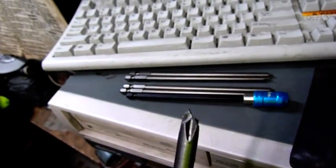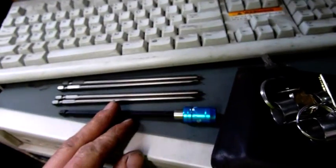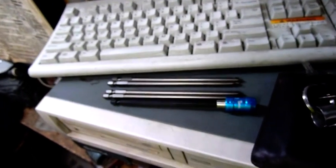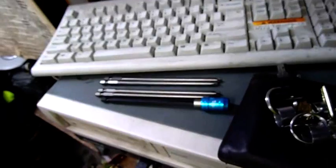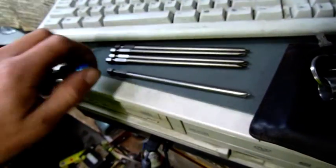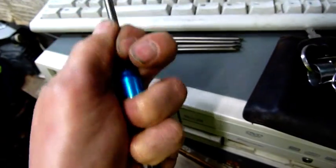What next in this constant parade of interruptions — that day can break my last screwdriver bit, just had to run out and get some more. Those screws are remarkably tight so I think I'll be using a socket on them. They're like a roofing screw with a cross-recessed head. Cross-recessed is like for service techs with big chunky screwdrivers, not these brittle hardened things attached to a power drill. I've got that and a little extension too so they can snap in and get down into the bottom of the cabinet without too much trouble. Good stuff.